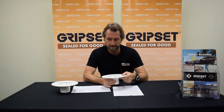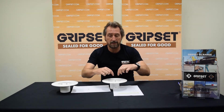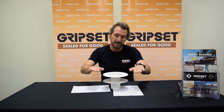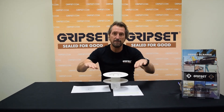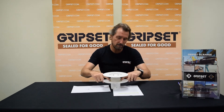So what is the critical step and how do you overcome that? We see two things you need to do. Firstly, a puddle flange should be used for both membrane systems. The base membrane should have its flanging — the floor membrane finishes inside the screed — and the screed comes on top and is laid without any waterproofing going on the edge of the screed. Then a riser or another puddle flange needs to be incorporated into the top membrane system. That way, the floor grate sits in the finished top membrane, and in the event that the top waterproof membrane fails, water going into the mortar bed hits the base membrane and can still drain into that leak control flange.